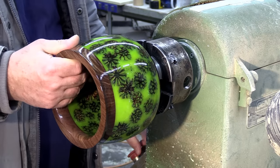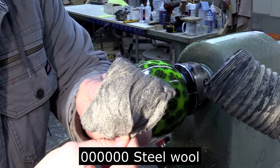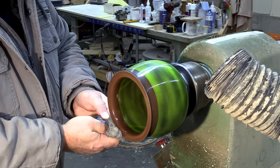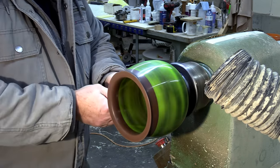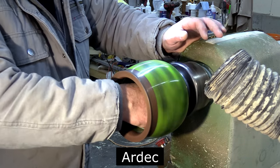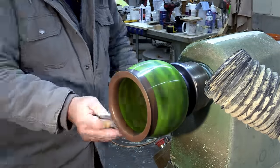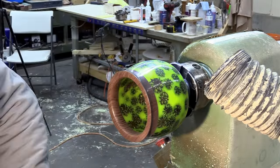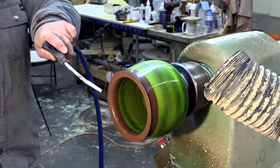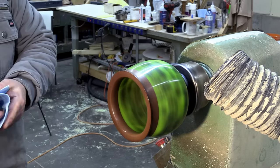This is the next day, and this time around, we're going to use some 6-0 steel wool. Yes, that's right. Not 4-0 steel wool, 6-0 steel wool. If you're curious where I got this from, it came from a company in the province of Quebec called Rd. I thought I would try it this week, and the main reason is I'm finding that because walnut is very porous, the few times that I've used it recently, the finish looks like it's getting really heavy. So I'm hoping the 6-0 steel wool will knock that down better than the triple E buffing compound. And I'm very happy with the finish.